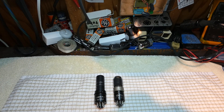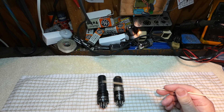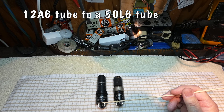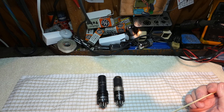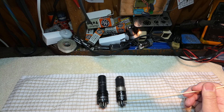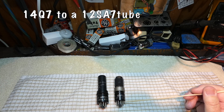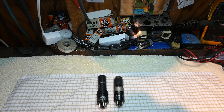Here's a different kind of tube adapter. I was going through some tubes, checking some out, and like Forrest Gump would say, life is like a box of old tubes — you never know what you're going to find. In these boxes I found two tube adapters. This one on the left will take a 12A6 tube and convert it to a 50L6, and you would put this socket into the socket of a 50L6 tube radio to play through. The one on the right is a 14Q7, which is a Loctal tube, and that converts to a 12SA7.